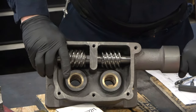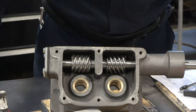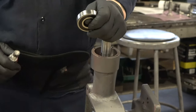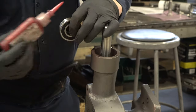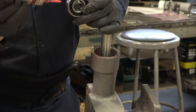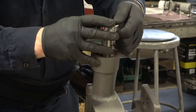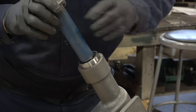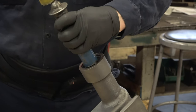As you can see, the worm gears are centered above the bronze bushings that the feed screw shafts are going to go through once installed. The drive shaft also has a bearing on this side to keep the shaft located properly in the housing. We also use Loctite on the inner and outer race of these bearings so that it does not spin inside the housing, as it is a slight interference fit. We use a special sleeve that lines up with the inner race of the bearing and tap it in until it seats itself.